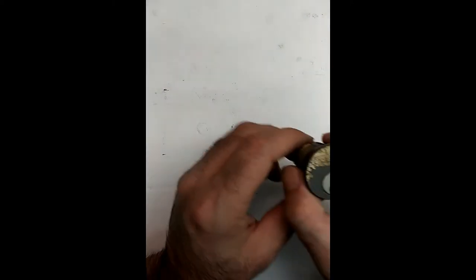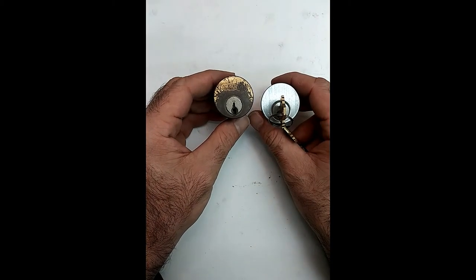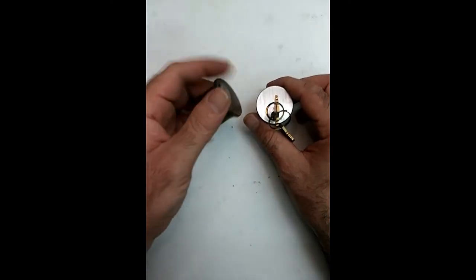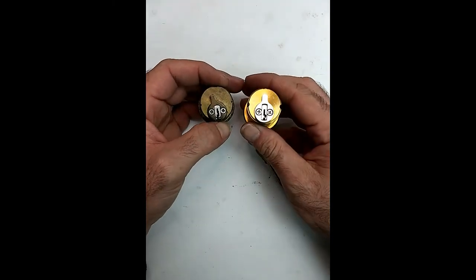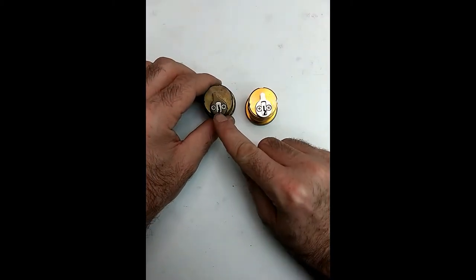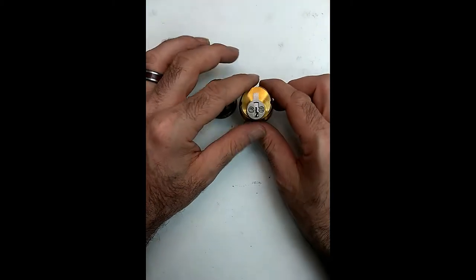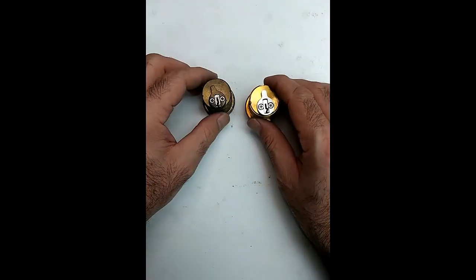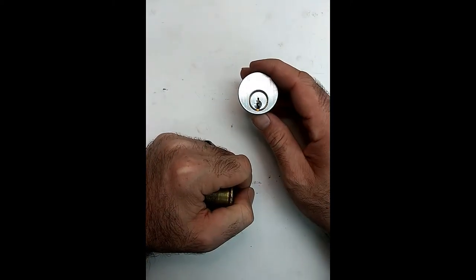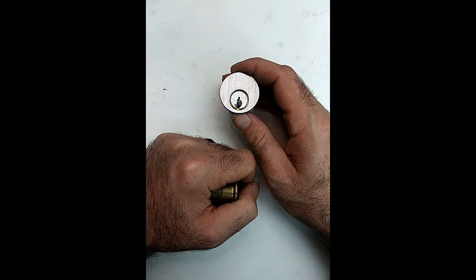The next cylinder up is this one. This one is a mortise cylinder, as this one is also a mortise cylinder. Again, the barrel diameter on this one is different than the barrel diameter on this one. Where they also differ has to do with the tailpiece on the back — on this one the tailpiece connection is shorter and wider, while this one is longer and skinnier. So tailpieces do not interchange from Sargent's to Ilco or PDQ. This is the more standard cylinder out in the world, especially for aluminum storefronts.